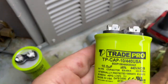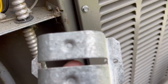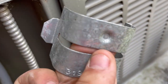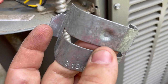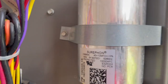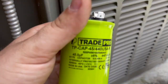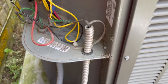I picked up a single 45 and a single 10. I save these brackets in case I have to do stuff like this. Technically this is for a blower motor - it's supposed to slide in a hole with one screw - but I can still run a screw through it. I think I can make this bracket work even though this capacitor is not as fat. If not I have plenty of other straps.